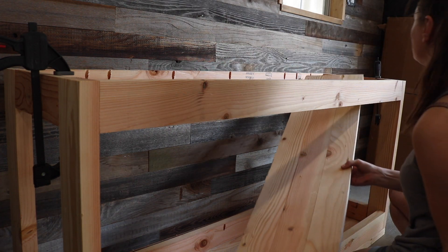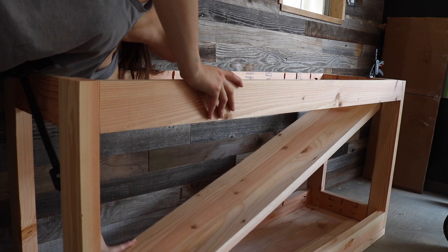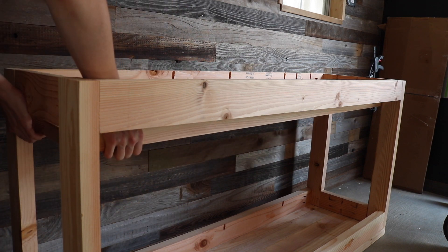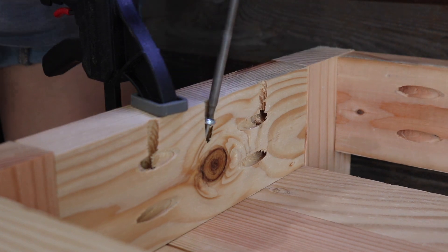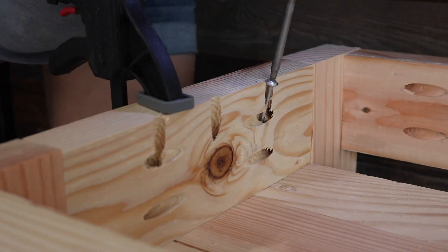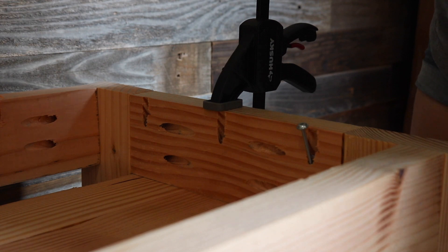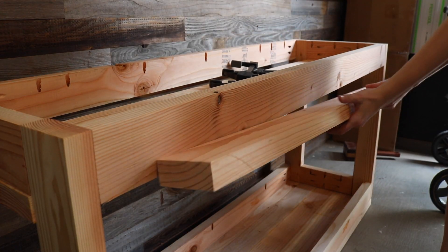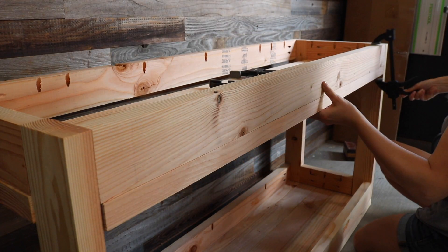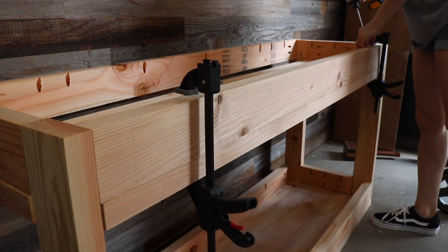Attaching the bottom shelf was a little tricky, and this is why I only glued up three panels instead of all five. I attached the three panels snugly to the inside of the sides and clamped them into place, then screwed them in permanently with pocket hole screws from the underside using the pocket hole openings I made earlier. Once that centerpiece was in place, I added the two shorter shelf pieces by clamping them to the frame and attaching them the same way with pocket hole screws from the underside.